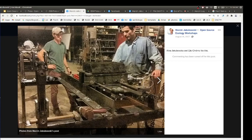Right now we have the 1-inch guide rods that the drawer moves back and forth on, gliding on these rods. We have the same system as the bushings for the CNC torch table, where we have a plastic 3D printed piece with the bushing inside, going on rods, so you get nice straight motion. And then on top of the plastic, the idea is using both plastic and steel, so you have heavy bolts and another steel plate on top. You create the geometry with plastic, but for structure, you need that metal.